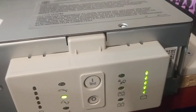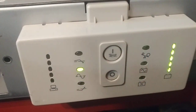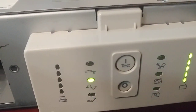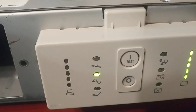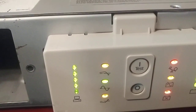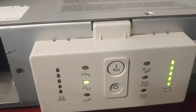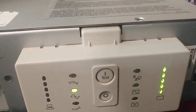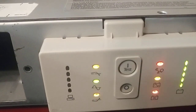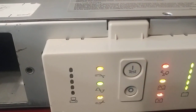Yours will be different even with the same pack; it just depends on your battery voltage. So let's keep going down. Shift B — we're going down. Negative. There we go — E0. So at E0, I press the up arrow and it saves it. 28.35 volts is when it stopped flashing. Now let's go up in voltage — Shift plus: E1, E2, E3, E4, E5. So E4 is where I need to bring it up to. So now I have to bring it back down — negative, negative, negative — E4.